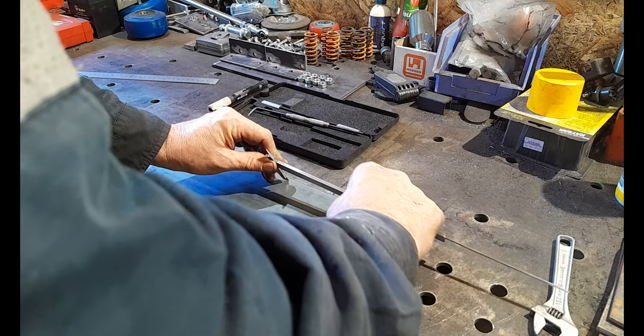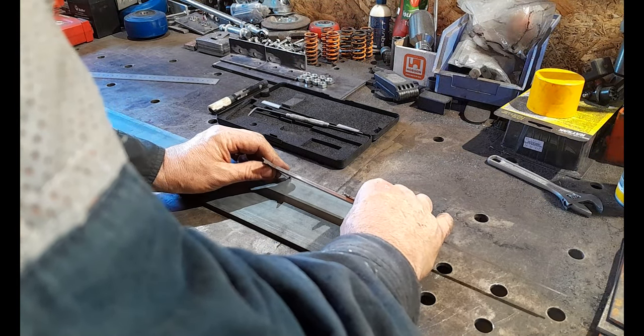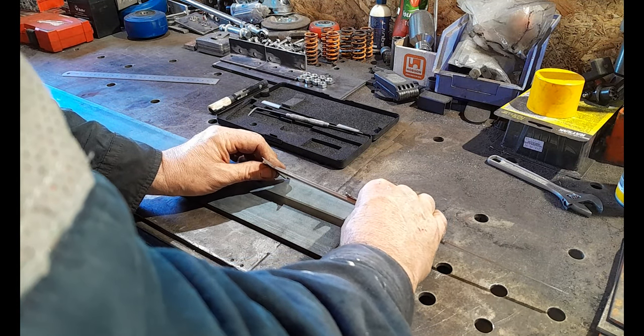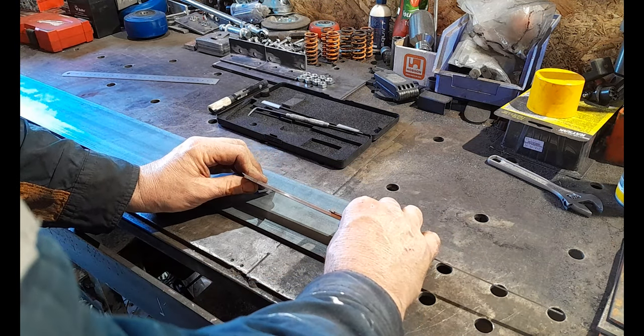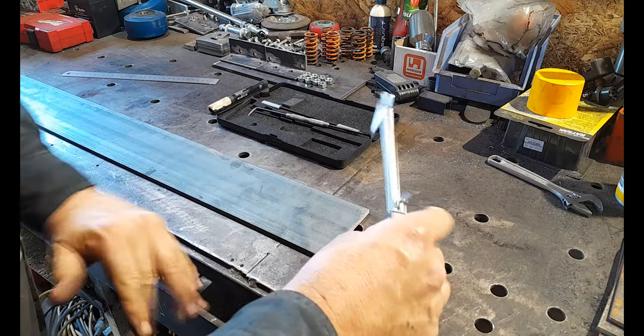Now, where I got this, it was purchased from the metal shop, I got them to cut it for me this morning, guys, to that exact length. It was cut in a guillotine, so I know it's straight on the end, okay? So I can quite safely place my scribe on here and get a scribe in at 120.